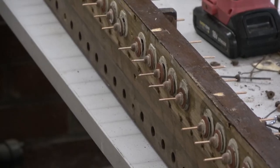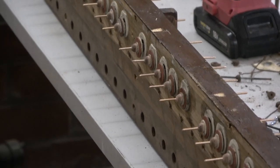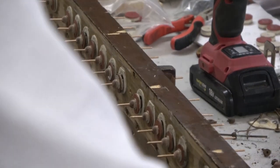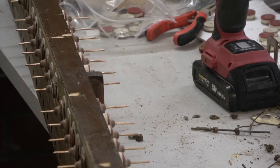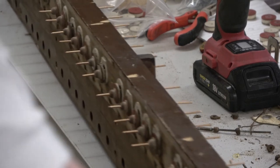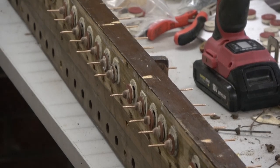About a week later — because it's very time consuming — all 30 valves have now been made. We've got new wires, new buttons. I've reused for the most part the leather washers, so the top valves are new. The lower ones are absolutely perfect so I've recovered those instead of making new ones. That's all 30 valves now put in. The idea is that one closes while the other opens, and I've got this spacing hopefully correct by carefully measuring using the photos taken during disassembly.